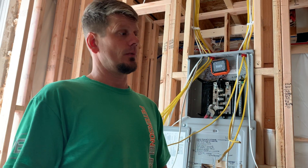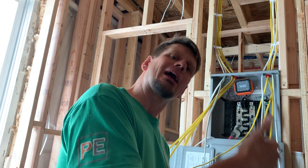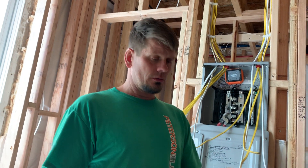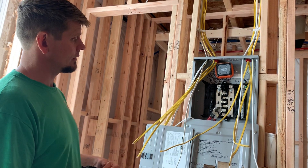The point of this video is: will we just come down and put in a sub panel so you can do all your work and save money? Look, if you grew up in the trade and you are an RW or a journeyman and you're presently licensed, I totally respect that — but then you'd be doing your own sub panel. A lot of people think on the load calc that they just want to oversize to protect themselves — that's not how you figure out your load. NEC 220.42 talks about load; 210.20 as well — there are many chapters when you're putting in equipment. I'm going to do another video on how this load was figured out. We're pulling 60 amps down here; after figuring out the cove heaters don't draw that much, I'd probably pull 50 amps. Figuring out that load is very important — if you do it wrong and you're in drywall, you can't fix it. You've got to know ahead of time what the customer is doing.